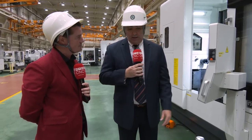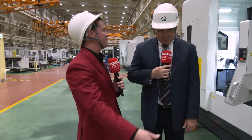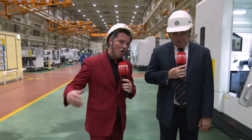Lights out — if you put a bar feeder or a robot, you get parts done complete in one machine. That's the 'set it and forget it' mentality, or fully automating your second or third shift. This is how we compete on a global level, how we make money and profitability, and how we reduce overall scrap and real estate in our facilities by combining these operations.